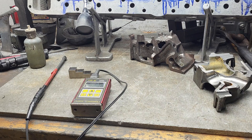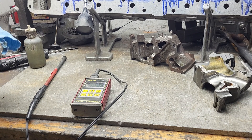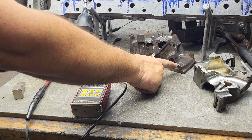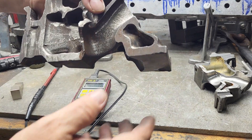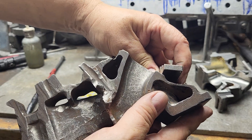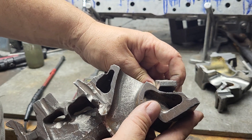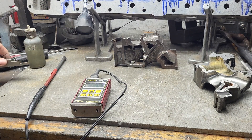So we talked about different ways to calibrate the ultrasonic. Is it a foolproof method? No. Is it pretty accurate when you get it set up right? Yeah, but you really have to stay on top of it. The way I like to do it is to set it for around 100 thousandths, which is about as thin as I like to go anywhere. I know lots of guys go down to 60 thousandths — that's kind of pushing it too much. If we go against our block, our block is 250. That's about as thin as you want to go.